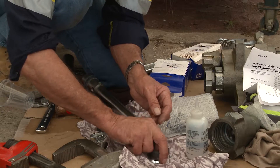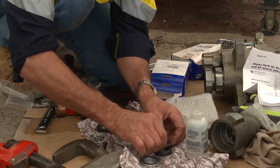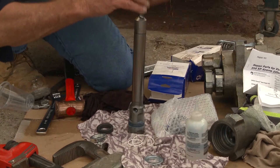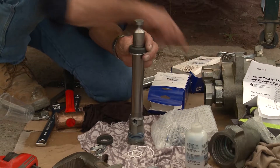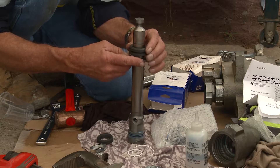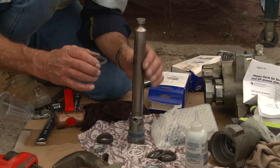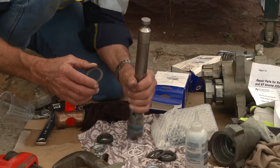After you've soaked these and you have the retainers, they're ready to go back together. Going back one step — we want to identify the wear on the piston. The top packings are the static packers; they're sustained within the top of the piston body or housing and don't move. This PTFE type of packing is the better one to identify wear because it has more integral wall strength to give you an indication of the wear factor.